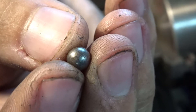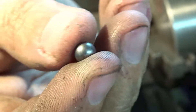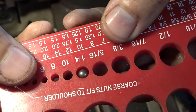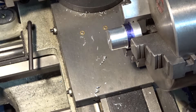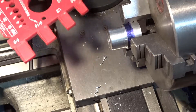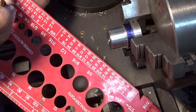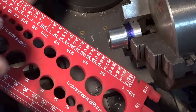Here's the ball bearing I'm going to use — nothing too special. It is a quarter inch ball bearing; it just barely fits in that. We're going to drill this end all the way through. Probably a number 10 or a number 8 — I'm going to say a number 10. It's bigger than an 8, not quite a 10, but it's 3/16ths.